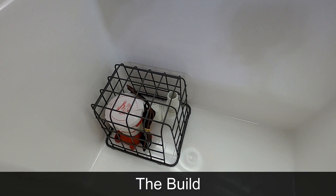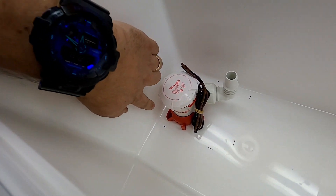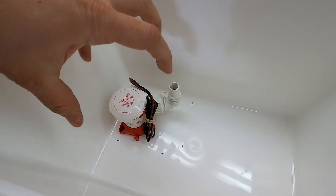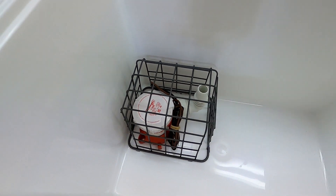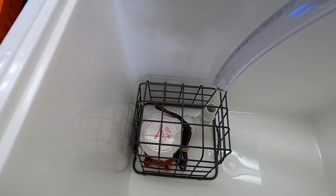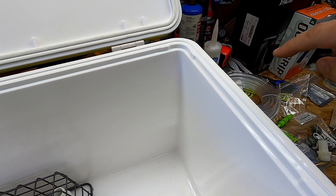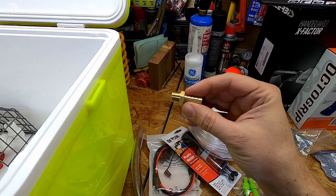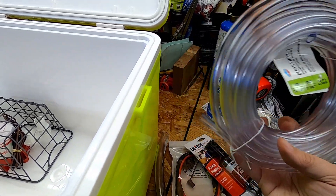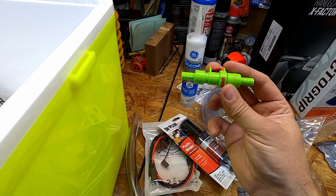It's pretty simple, so let's get to it. The first thing I'm doing is marking out with a Sharpie where the cage is going to go and where the pump needs to go. There's a little lock mechanism on the side which will allow me to remove the motor later if I want to. I'm going to epoxy the little cage over it, and a 90-degree elbow is going to line up with a hole so that the large clear tube can go out to the side. A bulkhead fitting will punch through the side of the cooler — that's where the outflow from the main line goes. That will get reduced down through a series of connectors to 5/16ths, which will connect to the hoses that run up to the driver. One dry break will be on the driver's suit, the other attached to the cooler lines.